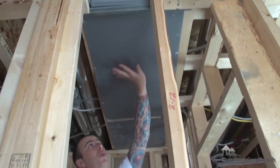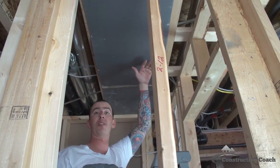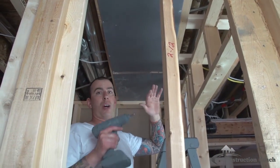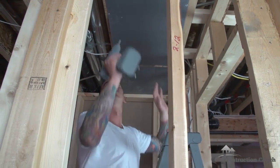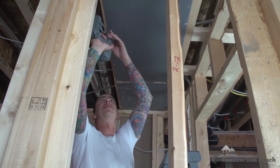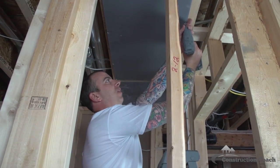I'm going to remove this piece of corrugated plastic because once our drywall is in here, it will do the sealing of the joist face to create the cold air return. So it's no longer necessary, and it will make your drywall bulge down if you don't remove it.